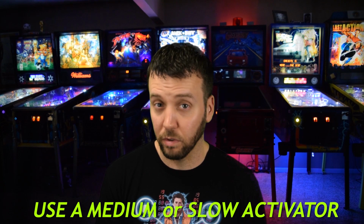One, I have a fast hardener, and that is due to the previous playfield I did during the winter. So I used a fast hardener, and it is currently in my garage at this point, like 95 degrees outside, 43% humidity, I want to say. So once this activator is in there, mixed up, stirred up, it's already going to work. It's already starting to activate the clear.